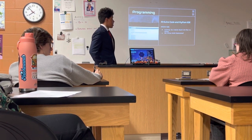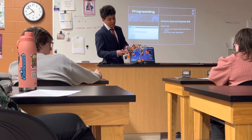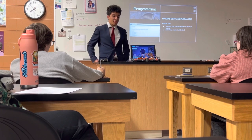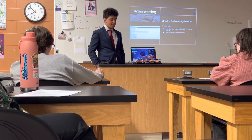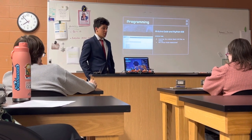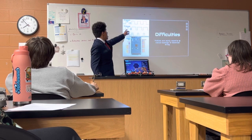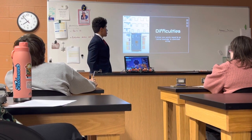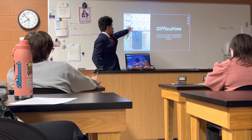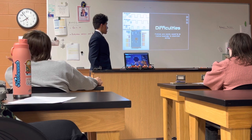The biggest part of learning the Arduino code was learning about the different pins — meaning where you plug in the electrical signals. That was complicated because certain types of pins have certain types of outputs. In particular, I needed PWM pins, which stands for pulse width modulation, and these have a square wave function where the top of the graph represents when energy is being supplied to the robot.